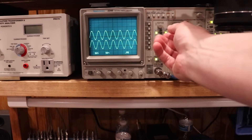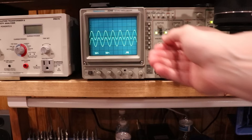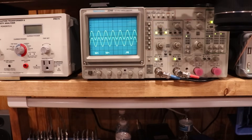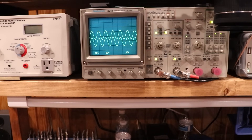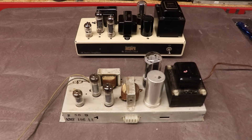Check it out — if I run the two channels superimposed on top of each other, we now have identical waveforms. So not one but two cold solder joints inside this thing. It can happen to the best of us. This unit looks good to go. I'm going to hook it back up, listen to it a bit, and then take it back downstairs to listen in the room.